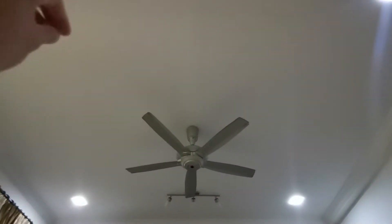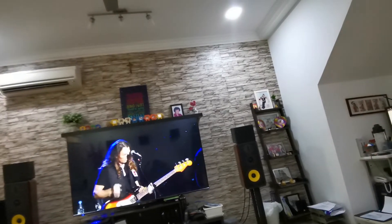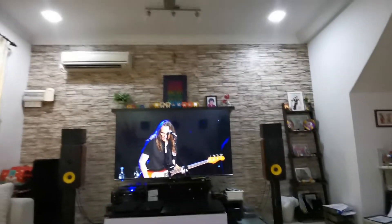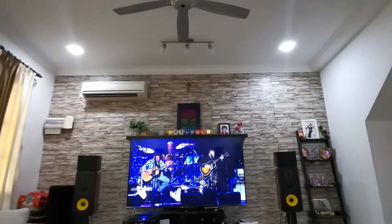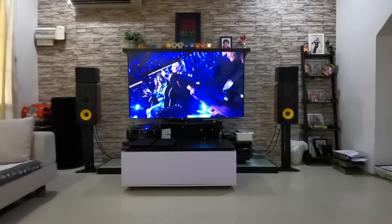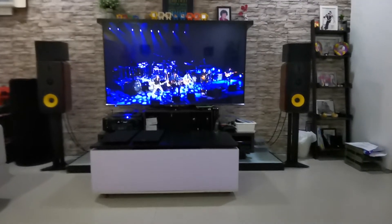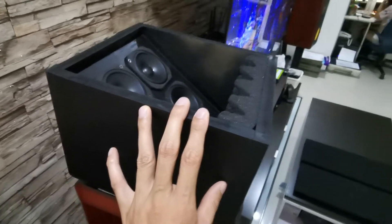I don't like speakers mounted right at the ceiling because the sound will be too localized, and if your ceiling is too low, the sound will be too direct and forward. Having Dolby Atmos speakers firing upward to the ceiling really disperses the sound wider — you have the whole ceiling as a speaker. Personally, I prefer that. It's also a better choice because I don't want to hack into my plaster ceiling to install speakers. So there you go — this is my Dolby Atmos build and I strongly recommend it. It sounds great.